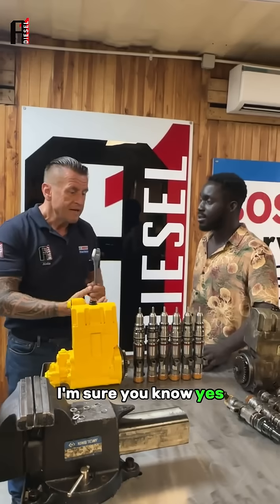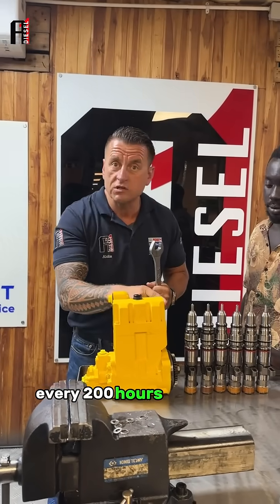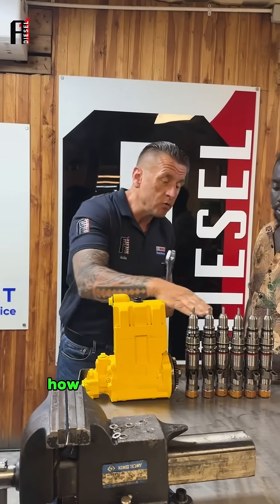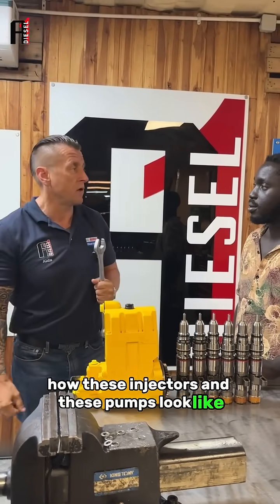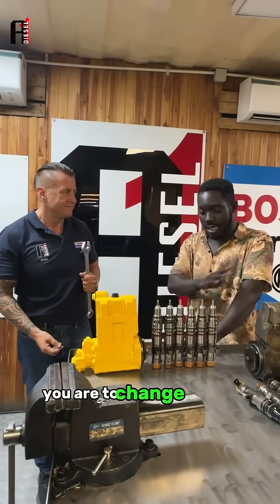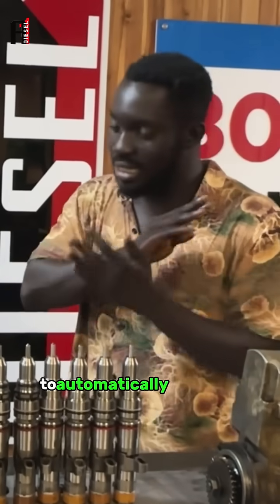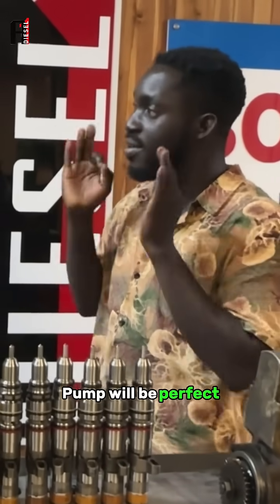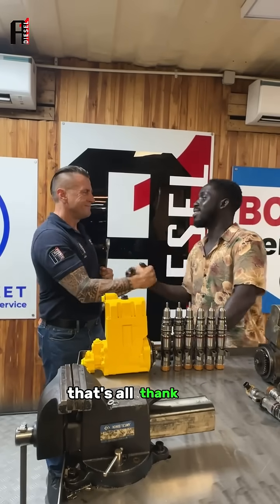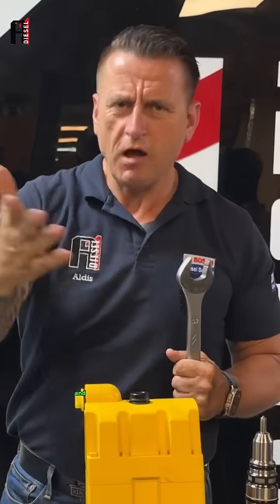But in our temperatures here in Ghana, you need to change oil every 200 hours — and I'm not selling oil, by the way. When you start changing oil every 200 hours, you forget what these injectors and pumps look like when they fail. That's the secret. Automatically, at 200-hour oil changes, the injectors and the hydraulic pump will be in perfect condition. That's all. Stay sharp and follow for more.